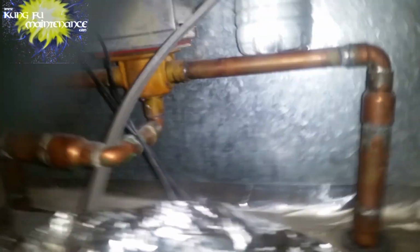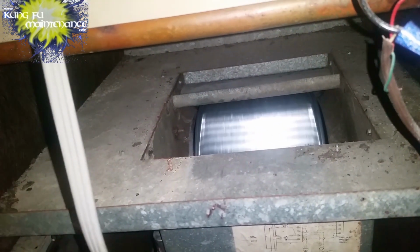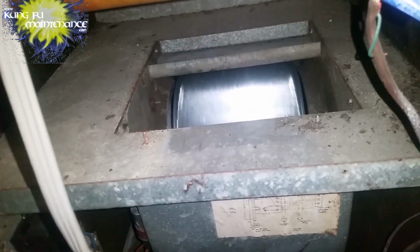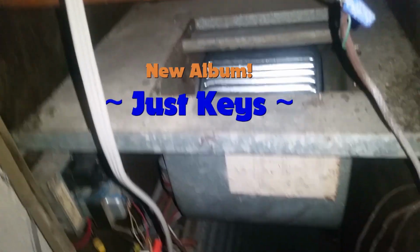And in order to make this unit work, I wound up having to take the motor from a vacant unit, or take the whole assembly and housing and everything, in order to survive for that day until the correct motor came in the next day. Changed it out, no big deal, but thought I'd share this one with you, in case anyone ever wondered, could you use a condenser fan motor to replace an indoor blower motor? Yep, always learning more, both from our mistakes and our victories. It's always something you can learn from the process, as long as you study to understand and figure things out.